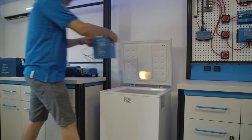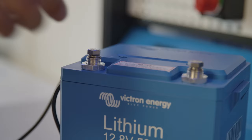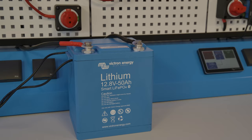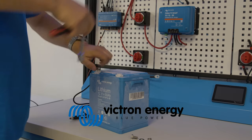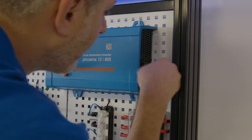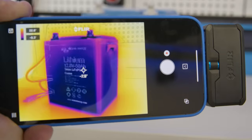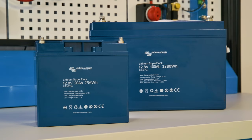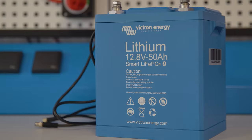This is the second in a two-part series where we talk about lithium batteries. In this episode we will discuss the Victron Energy lithium smart batteries, why we have a battery management system, and again stress test it in the cold and with a range of voltages. In the first episode we went through the benefits of lithium and discussed the SuperPak battery. Now it's time for the lithium iron phosphate battery smart.